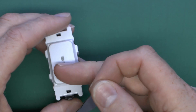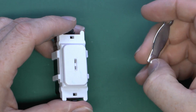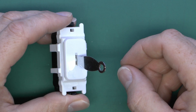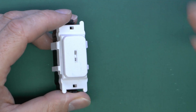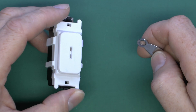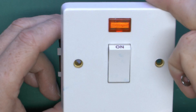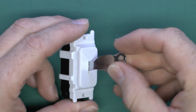The reason they're used with a key is because emergency lights need to be powered all the time and have a continuous supply. The idea is that when there's a power failure, the light will switch on using batteries inside the device, so you can see where the emergency exits are. These switches are used so you can turn off the supply to test that the batteries are still working. You don't want any random person pressing the switch on the wall, turning off the power to emergency lighting so the batteries run down. So it's purely there as a mechanism to stop people tampering with it. But electrically, it does exactly the same thing as any other switch.